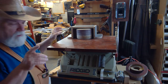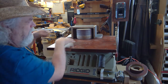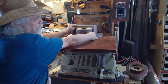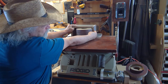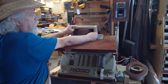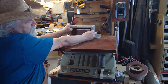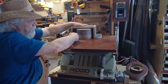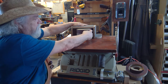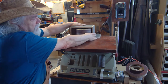You just set it here wherever you want it and clamp it down with a couple of clamps. One thing to keep in mind: because the rotation of this drum goes this way, you want to make this side as close as you can get it — whether you're going at the back or all the way forward, get it as close as you can without touching. When you clamp it down, all the sawdust will go into this side. The airflow on the far side will be much smaller, so this does a much better job picking up dust the closer you get on that side.